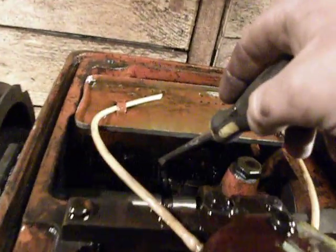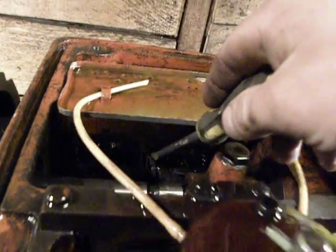I hope you can see those buttons on camera. Usually you need two screwdrivers but I will figure it out with one. You push in one of the buttons and spin the crown to tighten the pack of clutches. This is the forward direction — never adjust more than two clicks or you can damage your machine.